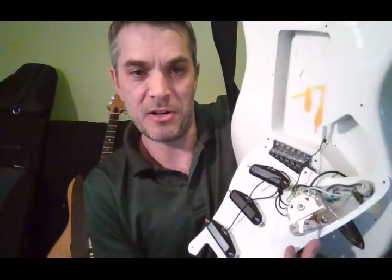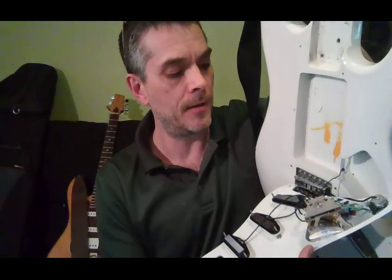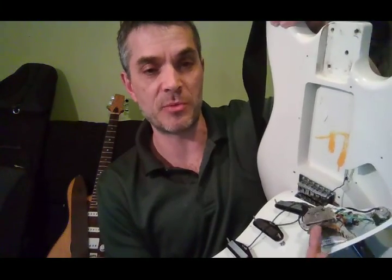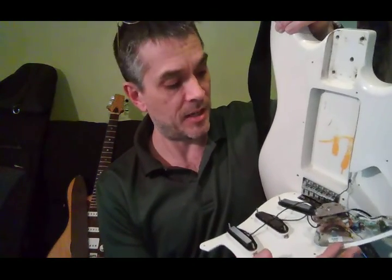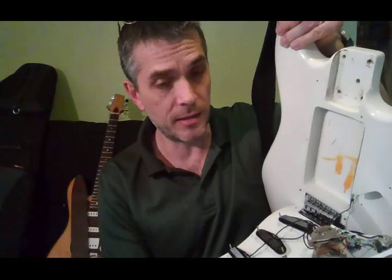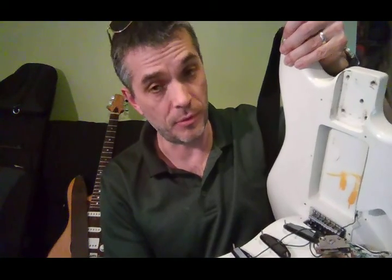Anyway, I got the thing off and what I have here is this really funky switch hanging off with a really lousy wire job. I'm not a fan of this very small gauge wire — it's going to be very hard to solder. What I'm going to do is disconnect everything from that switch. I have the other switch mounted already. Basically I'm going to wire the existing pickups to the new switch. I think I'm going to wire both tone controls — this is a student guitar and I think they'd rather have a tone on the bridge also.